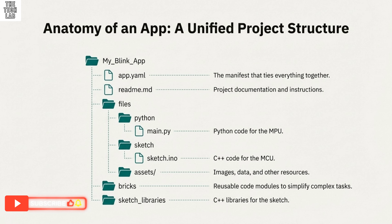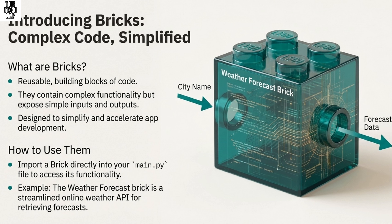The whole microcomputer environment runs a full-fledged Debian Linux operating system — a massive shift. You're not just uploading a small program anymore; you're basically managing a desktop environment and complex processes. The programming language for this side is Python. For memory, it ships with 2 gigabytes of LPDDR4 RAM, with a 4 gigabyte model anticipated for a future release. Running Debian Linux at 2 gigahertz puts the UnoQ directly in competition with small single-board computers like a Raspberry Pi.